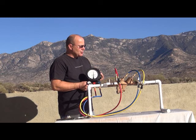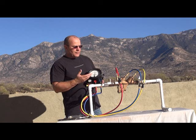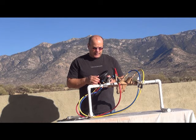Our last step is to bleed the low side one more time and get our final reading across the number one check. Once the gauge settles, we have an 8.0. So our first check is 8.0, the relief valve is 2.8, and the second check is holding tight. We have a good RP.